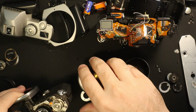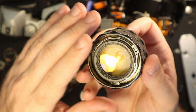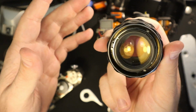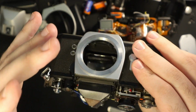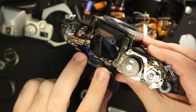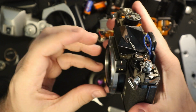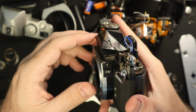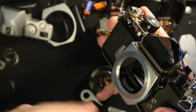And when that plate gets pushed forward, this gets depressed, and whatever aperture your lens is on will then read through the lens. This is stopping down the lens, or it also is creating a depth of field preview, all of these things. But the point of that is to create lighting conditions conducive to what the camera is going to shoot, because the whole metering system is just these two cells and the resistor here, and power coming in through here. But you put the lens on here, and it has to stop down the light coming in through the lens and then factor that into what settings you have here in order to get an accurate light reading. So there's really no way to get a reading otherwise, unless of course you were to use your phone.